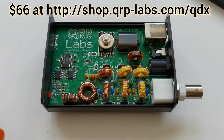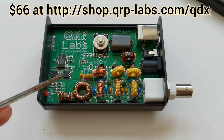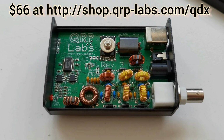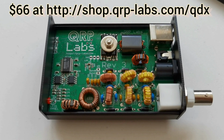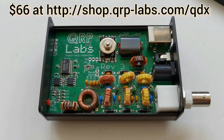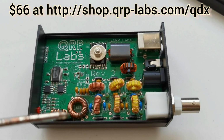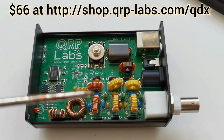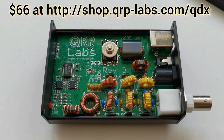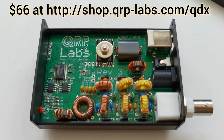It has a differential input, and I had to design an instrumentation amplifier arrangement for driving that, which does result in slightly improved performance, as well as in some scenarios I think there'll be some performance advantages. For example, in noisy environments or with noisy power supplies, there should be a better common mode rejection. Apart from that, I did some rearrangement to move some of the circuit parts around to improve the signal flow, just to make shorter connections between the various modules of the circuit.